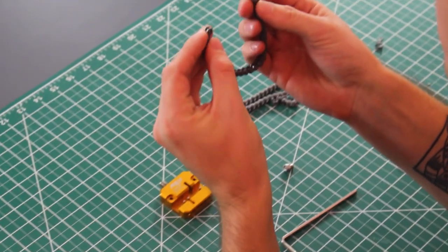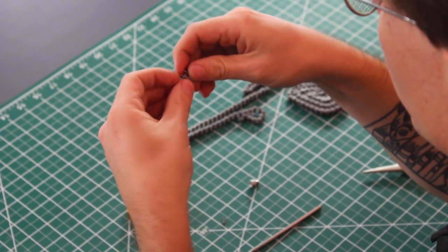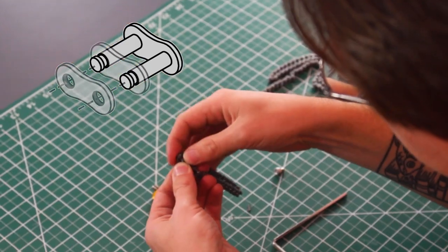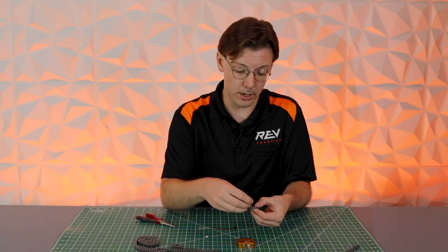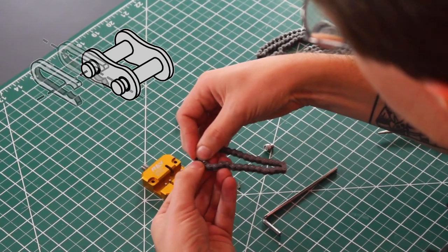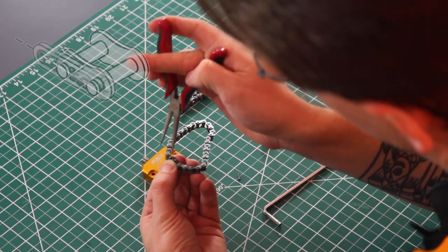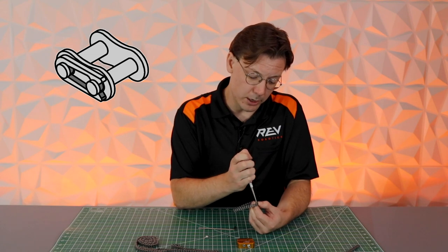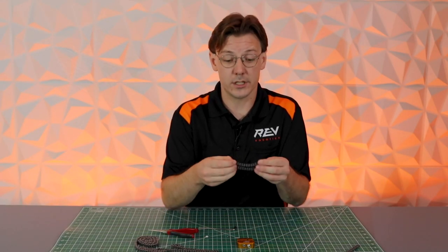The next step is setting in your master link. Take the piece of chain you just broke, making sure you have two inside links together. Take the pin portion and connect one end of the master link to the other set of chain. Then take the plate, put the plate over the top, and then you need to take your clip pin. This is the most difficult portion — actually seating the clip pin onto the device. Push it down so it is sitting on top of one pin and leaning into the other. Take your needle nose pliers, place them below the pin riding against the top of the clip, with your fingers on either side to help keep it in place, and squeeze. It will make a little snapping noise and you'll know it is in place. Once that's done, your chain is ready to go — place it on your sprockets and onto your robot.